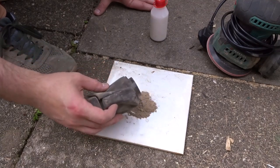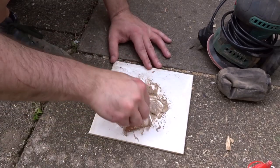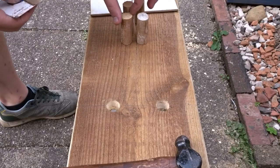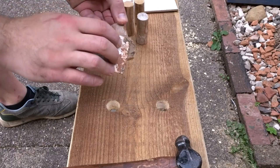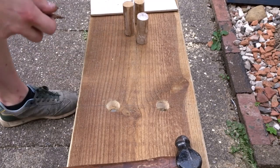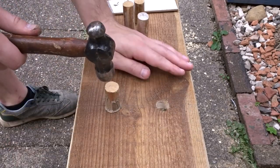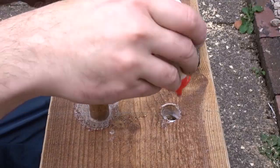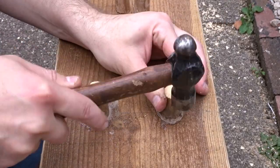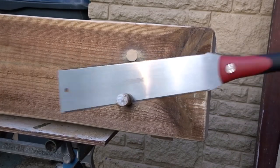So now I wanted to make up a bit of wood filler, and for that I've used some of the sawdust from my sander and some wood glue, mixing it all together to give me a nice fine paste. I want this so that I can add these dowels - they are a good fit but they're not super tight, so I'm just going to add some filler around these dowels and in the holes to make sure it's a really snug fit. I'm tapping them down with a hammer, and that groove I cut in there earlier will allow some of the excess glue to come out under pressure. Once that was all dry I used the pull saw again to cut off the excess pieces of dowel.